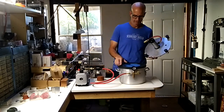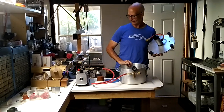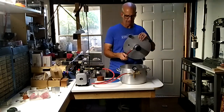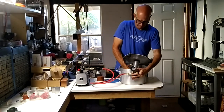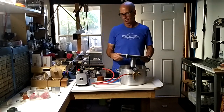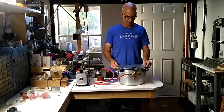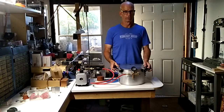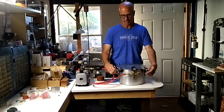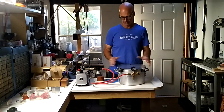So what happens is you've got your casting sand down in here. Inside here there's a part that this fits onto — push that in there, quick release. That part hinges around and allows this to sit down on top really well. I took these rubber parts here and made them so they're drilled off-center, so you can turn them and it tightens the top against the bottom.